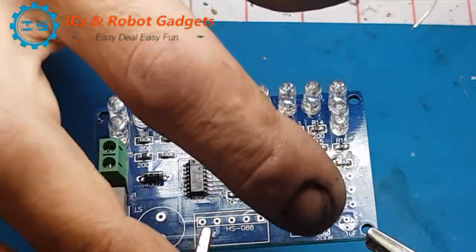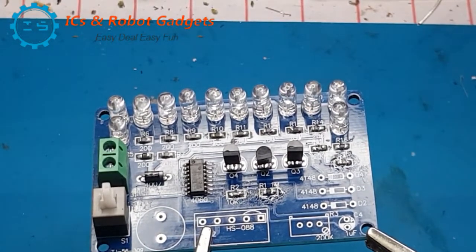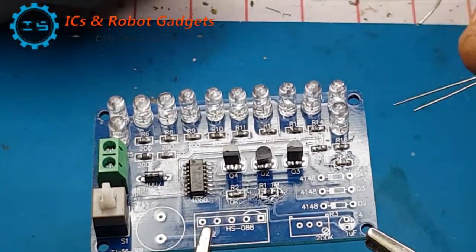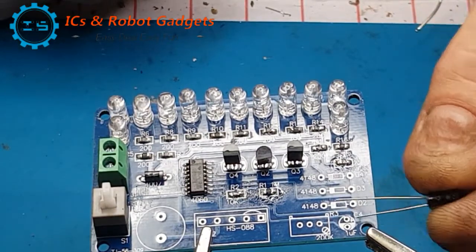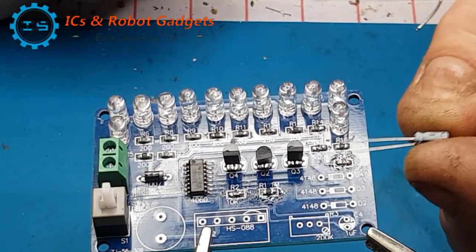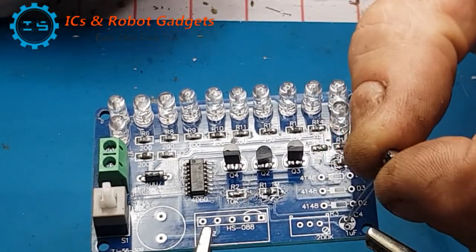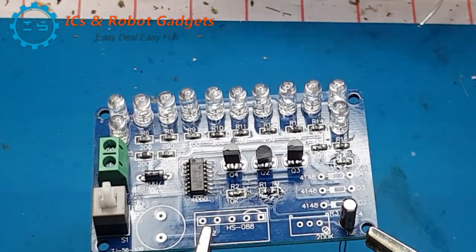So we'll get the three Zener diodes, I think they are, 4148s. We get those and the capacitor in, and then we'll tackle this bit. So it's a 1UF 50 volt electrolytic capacitor. Usual precautions, long leg positive, short leg negative. They've marked a pos on there, so we know that's the long leg. And the white side of the circle matches up with the minus and the white side of the capacitor as usual. Pop that little puppy in. And a dab of blue tack.